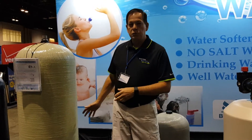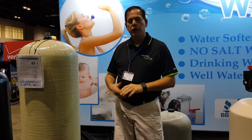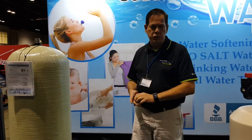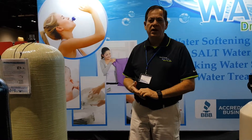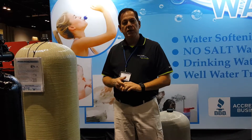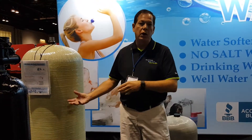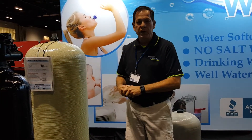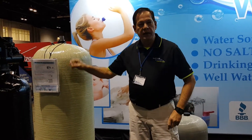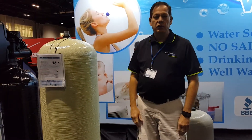Yeah, and like I said, this is one option. For people that have a lot of problems with their water — whether it's yellow water, water with iron, water with sulfur, any of those things, bacteria — this will solve all those issues. And again, we do sell other types of filtration that are also chemical-free systems. But one of the things I want to reiterate: a lot of people say they don't want chlorine because they believe you're putting chlorine into their water that comes into their house. What we do is we chlorinate your water to fix your water problems, but then we take the chlorine out — we remove that chlorine before it comes into your home. So that's how a dry pellet chlorination system works.